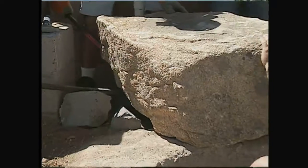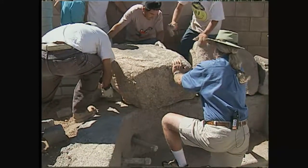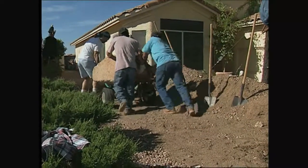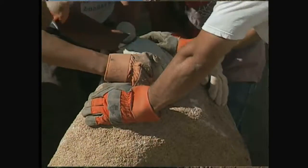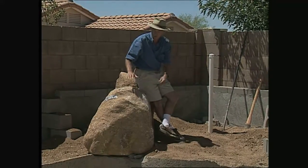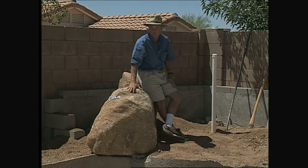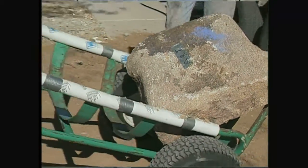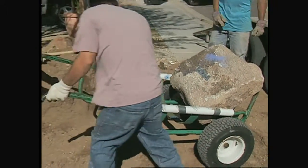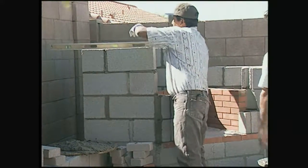We've already placed the boulders over at the spa, and now we're ready to get the water feature boulders in place. Because the access on this job is very difficult, all the boulders are being brought in by hand on a large two-wheeled cart. These boulders are very heavy — a boulder weighs about 110 pounds per cubic foot, that's 12 by 12 by 12 inches, so this one here weighs over 700 pounds. It's really hard work. As we continue to bring in boulders for the water feature, there's work going on in another part of the yard — the bar area is really beginning to take shape.